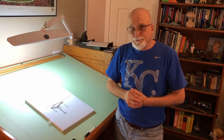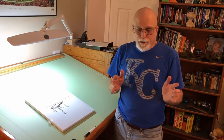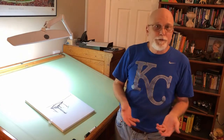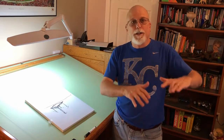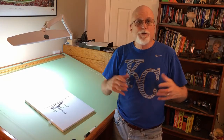Once you've decided on what it's going to look like, then you've got to make some drawings. But before you start doing that, I think the best thing to do is to make some mock-ups. Like if you're doing a table, there are standards for how high a table should be depending on whether it's a coffee table or a regular table. You can look up furniture standards and they give you chair sizes and standard furniture sizes. But if you're going to make something like a nightstand that you want to customize for your bed height, you can get some cardboard boxes and just set it and get a height that you think is going to work. And the same thing — you can make a cardboard top of how big you want it to be. If it's a little more ornate, you can make a full-size mock-up out of cardboard.